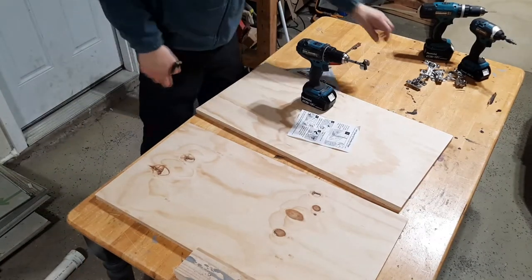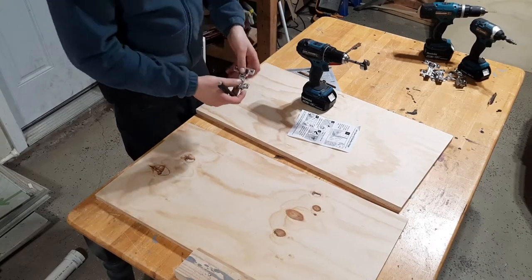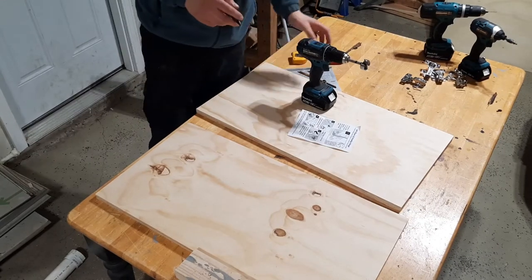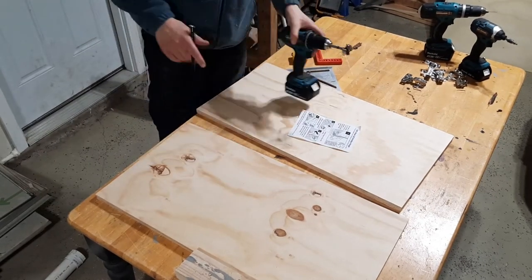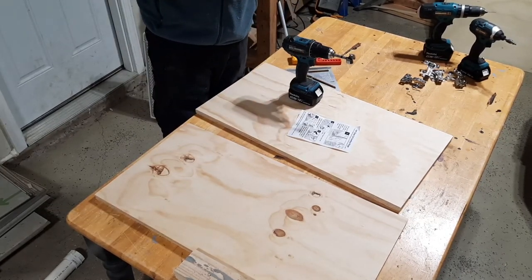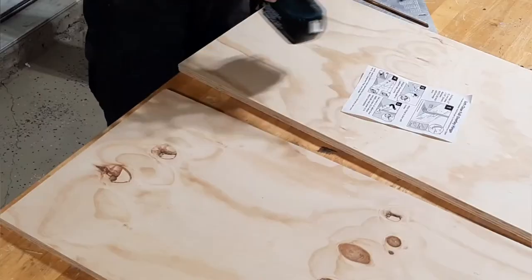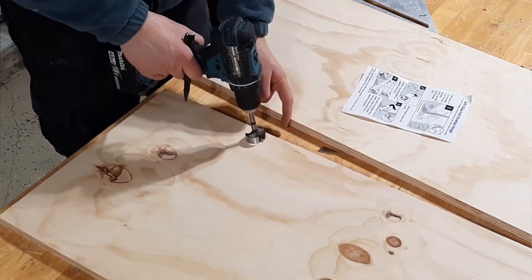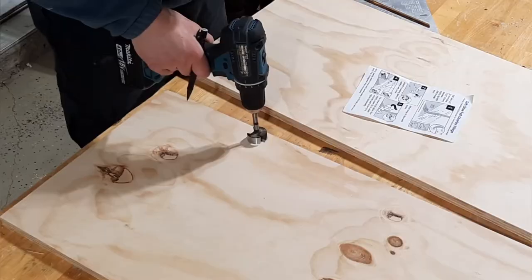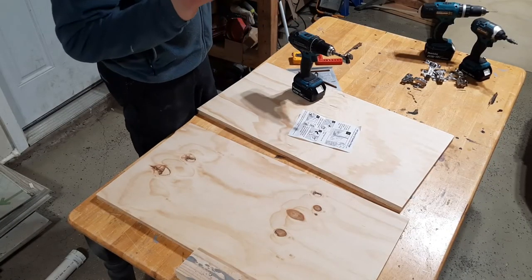We're having some issues with the door hinges — they're soft-close overlay hinges, and they're kind of cheap from Amazon, but this is a budget project. I'm using a 35mm bit to drill a couple of holes in each door. I practiced a number of times to get this right. The key measurement is 42 millimeters from the edge of the door to the edge of the bit, and that allows the door to cover the carcass of the cabinet when it closes.